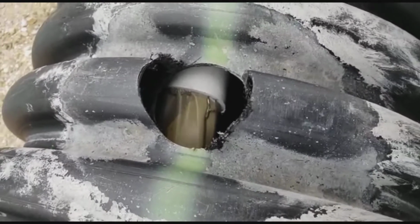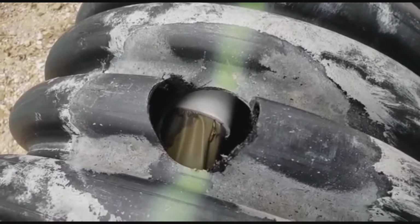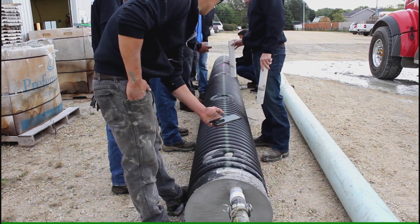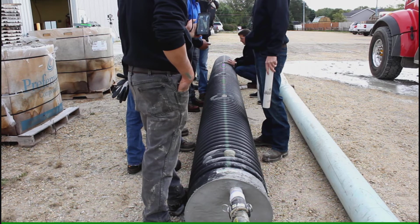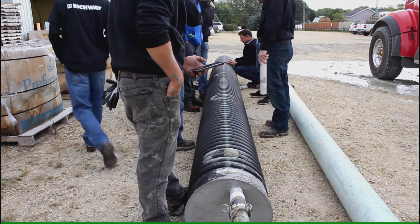Would it flow along the bottom of the pipe and then rise to the top, or would it fill one end of the pipe first and push to the far end? As with the first pipe, we used one of our CT30D machines, but decreased the material density to about 30 pounds per cubic foot. This is a pretty typical density used on abandonment and geotechnical void fill applications.